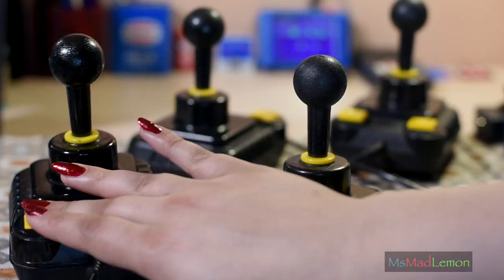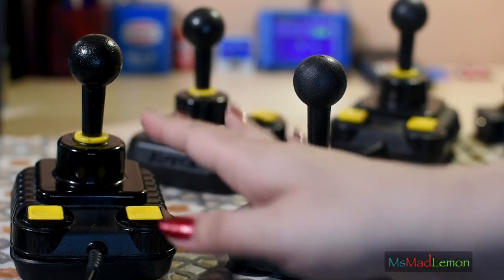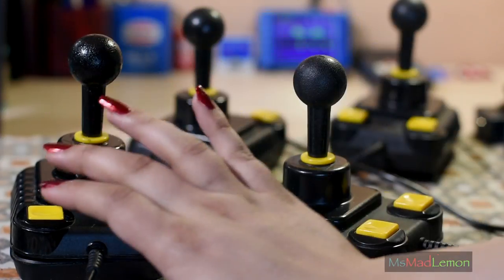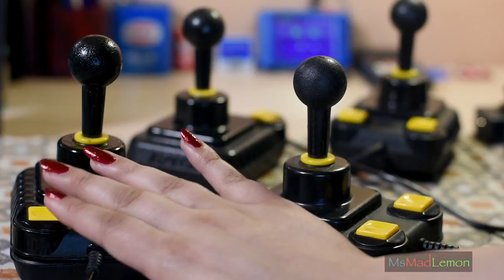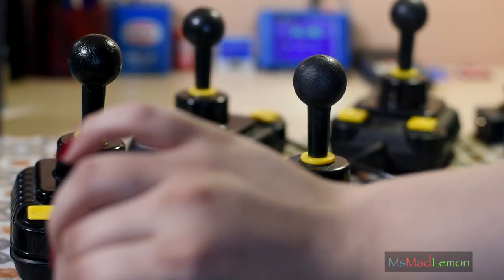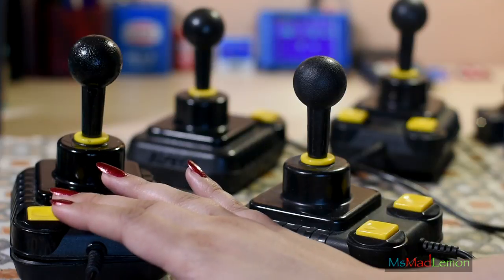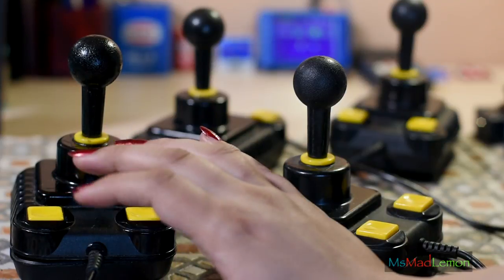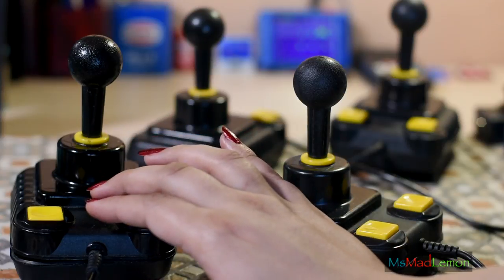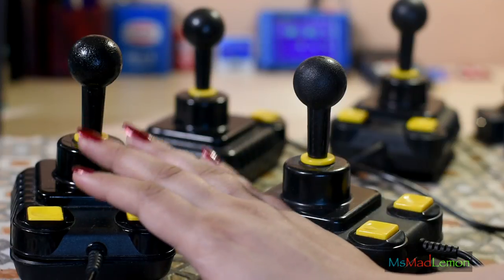The one at the front is the one I restored a couple of years ago in my last Zipstick restoration video. Even though the microswitches have been replaced, it still gets stuck on one side — you click one direction and it stays there sometimes. It's got a sticky microswitch, I think. If it's not the microswitch then it's definitely the wire, because there's some bareness in some of the wires showing — maybe it's getting some shorts. I need to rectify both of those issues.